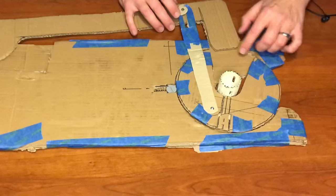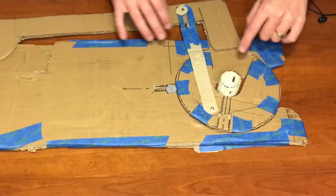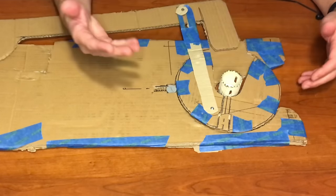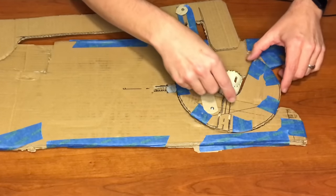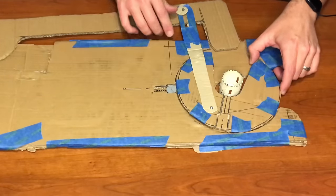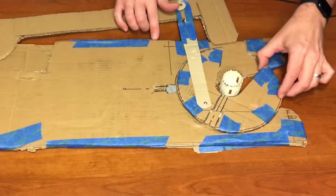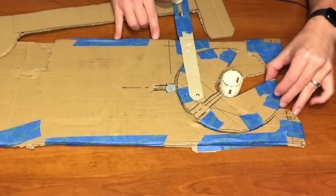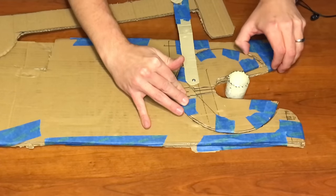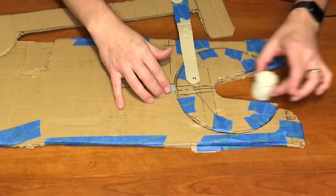And right as it clears right there, now that the assembly has cleared itself here, there is nothing holding this jaw. And the weight of the train pulling down the track, because remember you're at like a 55 degree angle at this point, the weight of the train is trying to rotate this jaw, and it's starting to work. But then that cam rides just a little bit further up and it assists, and then that jaw is able to rotate all the way back around. And then at this point, the train is free, and the jaw rotates 100% back around, and the train suddenly goes.